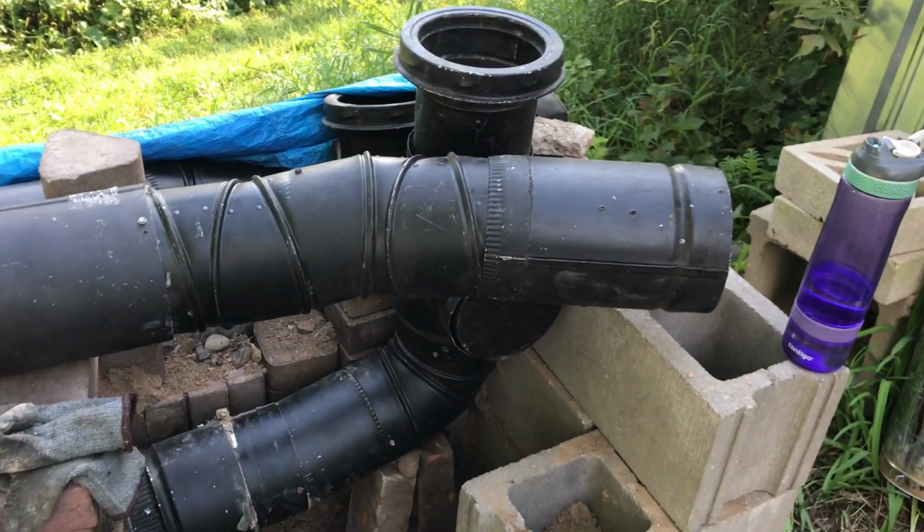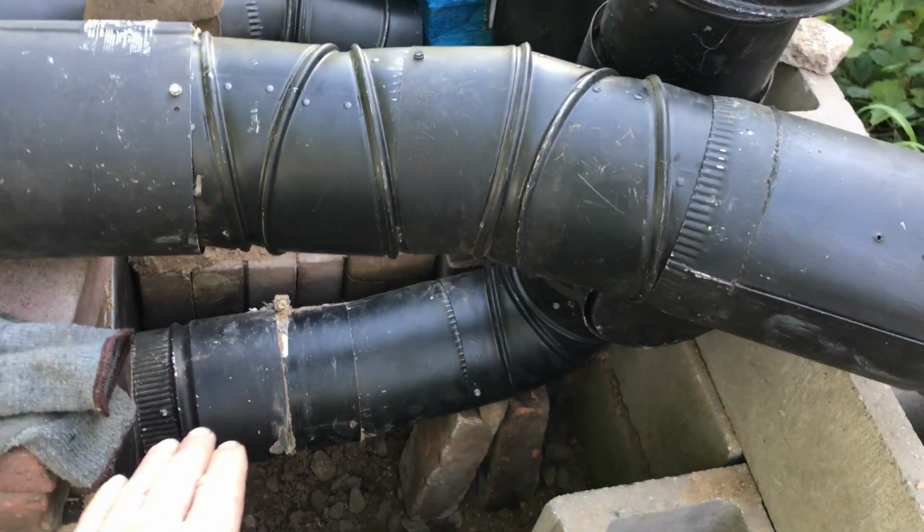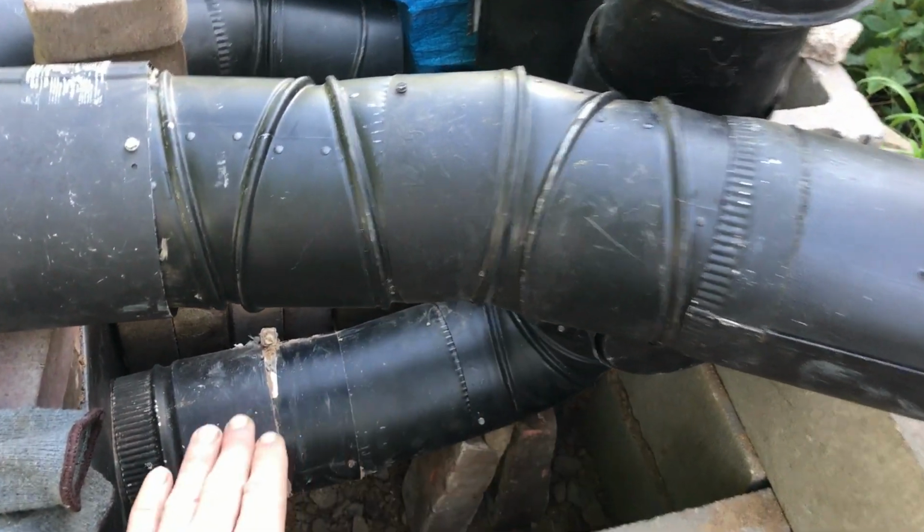I did find out that if the stovepipe made too many twists and turns, it wouldn't exhaust properly and there wouldn't be enough draw in the actual wood stove. So that wasn't going to work. I had to go with a more conventional straight elbow up, across and then up.